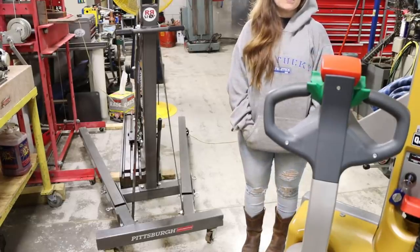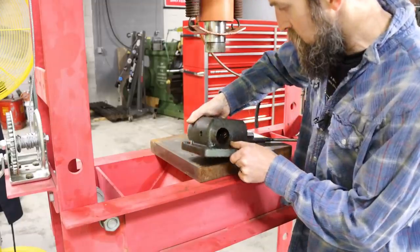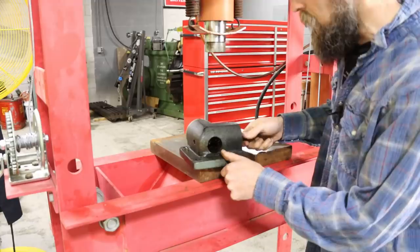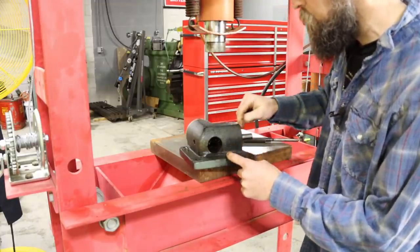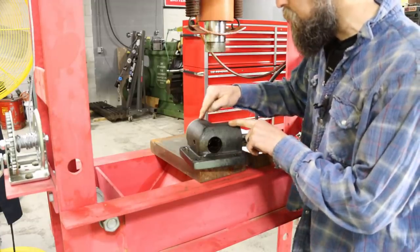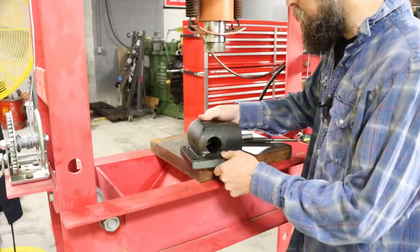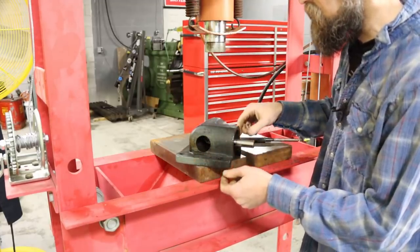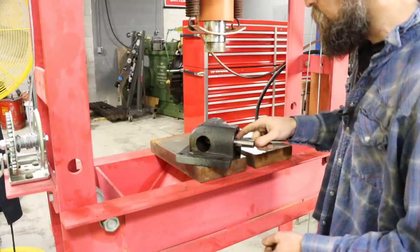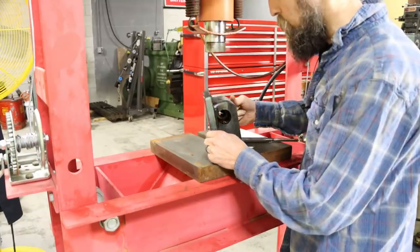So this gearbox, I mean, I can't even turn it by hand. I don't know that I should be able to, but I'm suspecting that I got a bearing issue in this 90-degree transition. That's going to be a pretty high load area. And because it had the broken dowel, because the bolt was loose in it, because it was missing the snap ring, I want to pull it down a little farther and have a look at it.